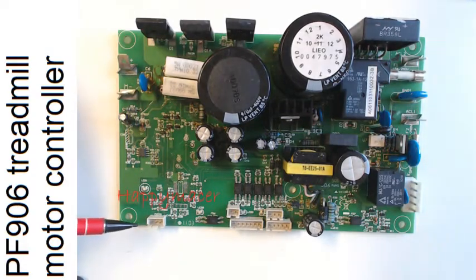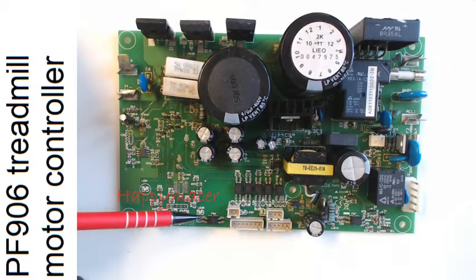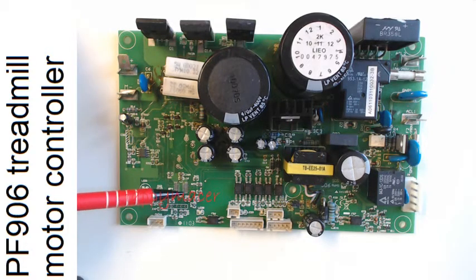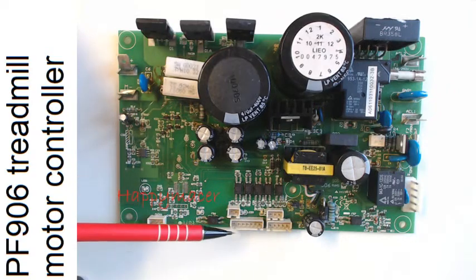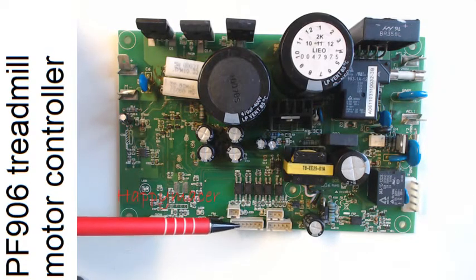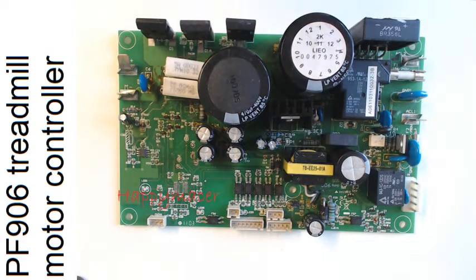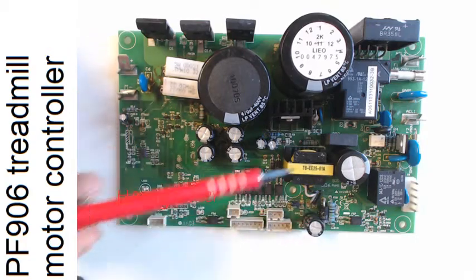This is the old RPM sensor that was on the main motor — I'm not using that so I haven't paid much attention to it. These two terminals are the outputs from this optocoupler, and the optocoupler is driven by the PIC chip to output signals back to the control board. J3 and J4 are really of interest — I have worked out the pin-outs on these and I'll publish them separately as a schematic of the electronics of this board. FR7 is in here somewhere as one of the terminals to drive that relay.